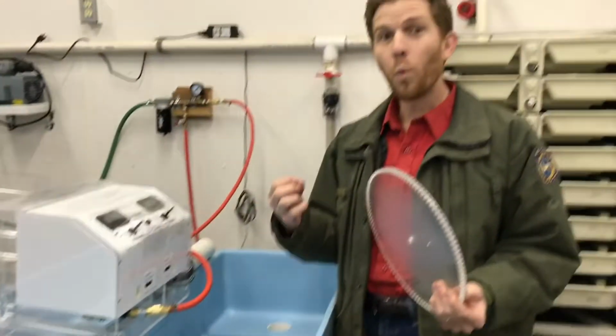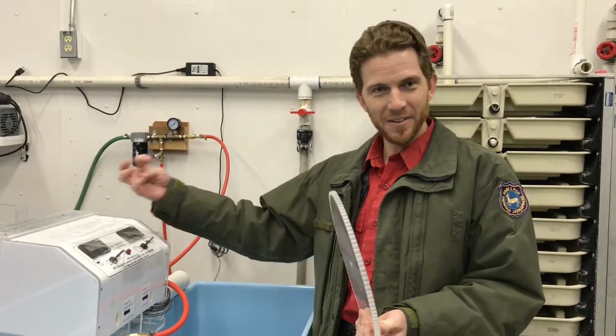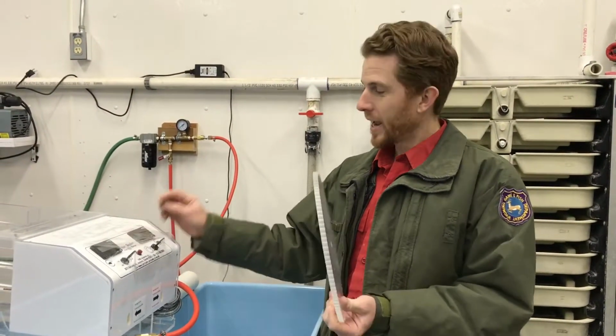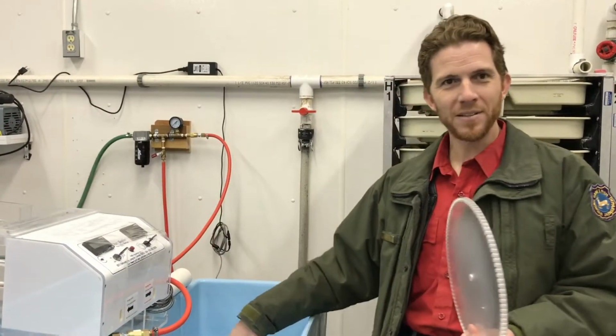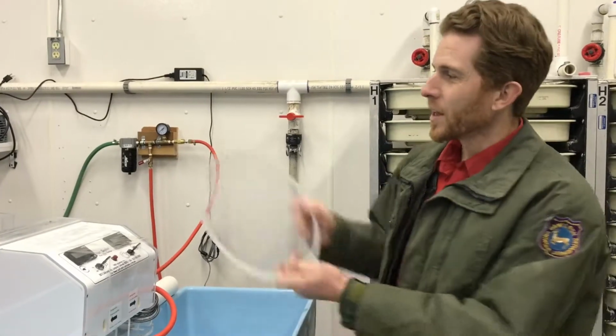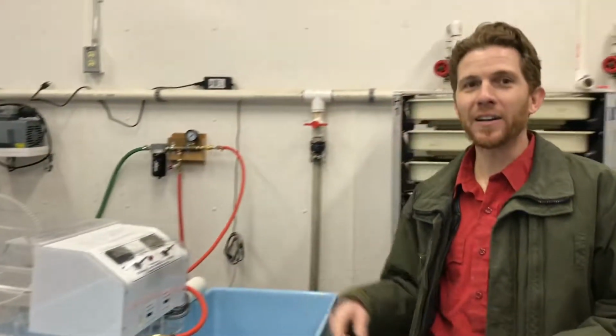If the egg is one of the white dead eggs, they are not translucent. So the sensor does not see light. It uses a little burst of air and shoots the egg out, and it comes to a basket on this side. The machine isn't 100% effective. We'll still have about 1-2% that we'll have to pick out on our own.